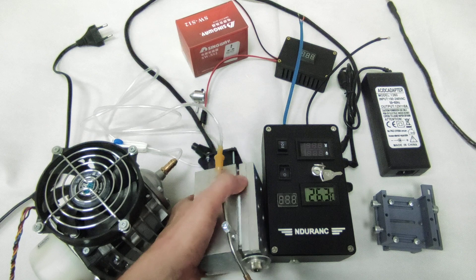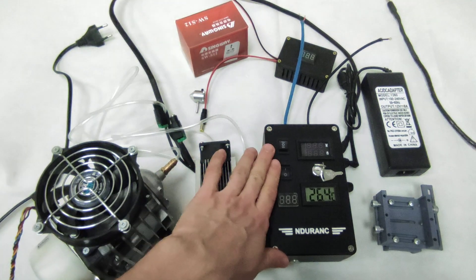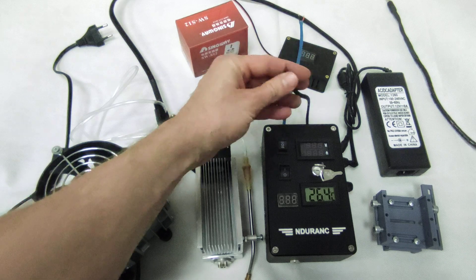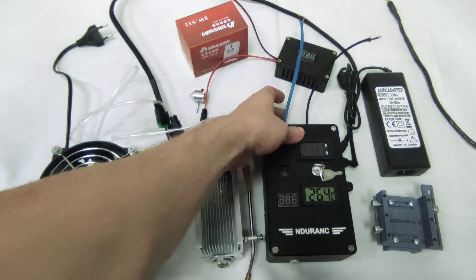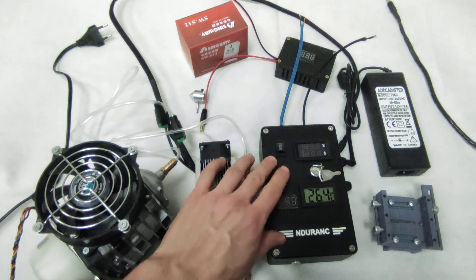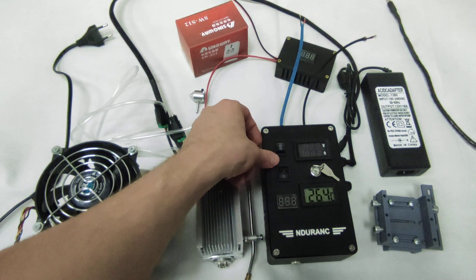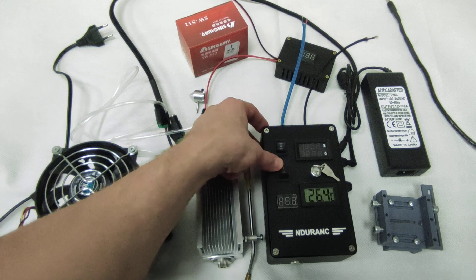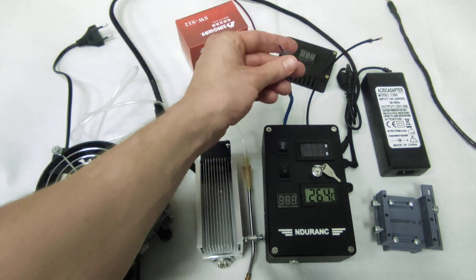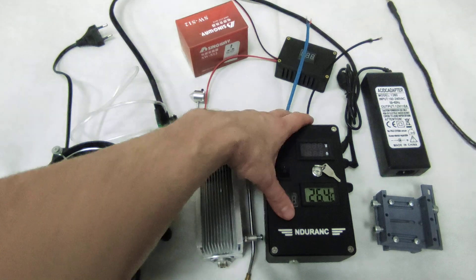It has two TEC coolings over here, and it has a metal laser box with MO2 PC board. We have analog wires. If you have an older CNC machine that needs analog input or PWM to run the laser, you just need to turn on your box. At the first position on zero, you can run the laser with PWM — first is full power. Second position is analog mode.